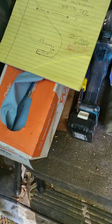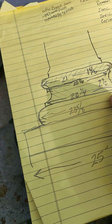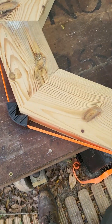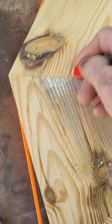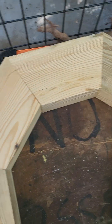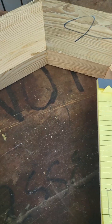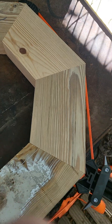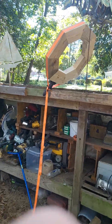That octagon will eventually be 23 and 5/8 inches. What I'm planning on doing — I haven't quite made my mind up — I'm either gonna biscuit joint just for added strength, or I'm gonna take a slot cutter and groove the length of this joint and then put a spline in there, which would probably be better. I'm still vacillating on that. I've got that one and this one dry fitted.